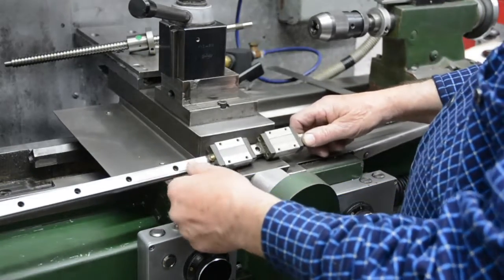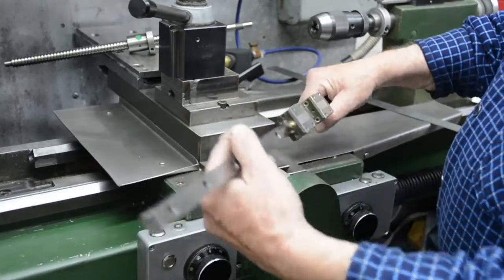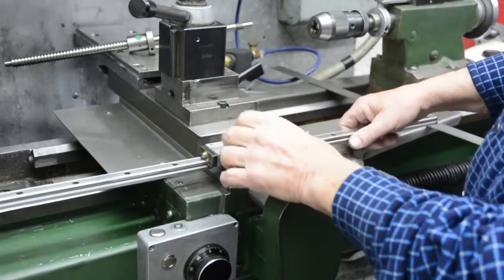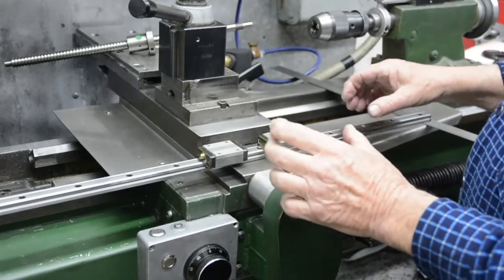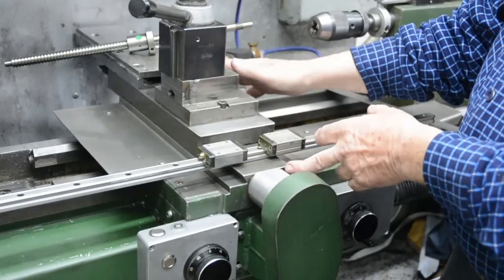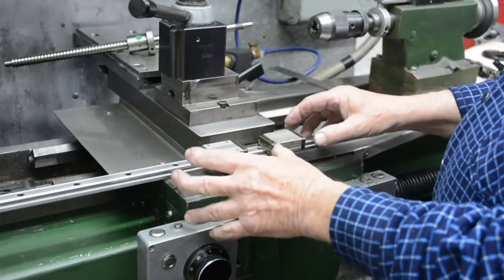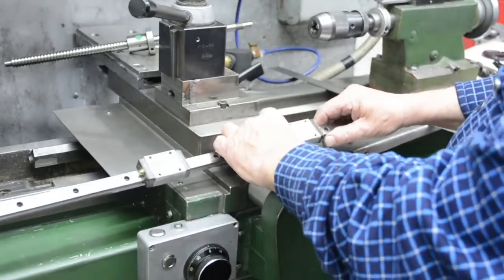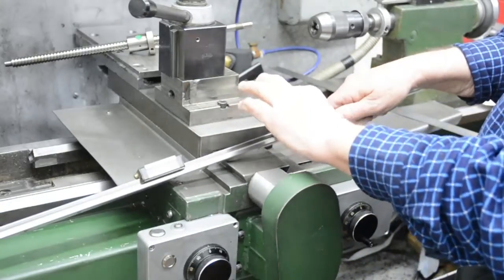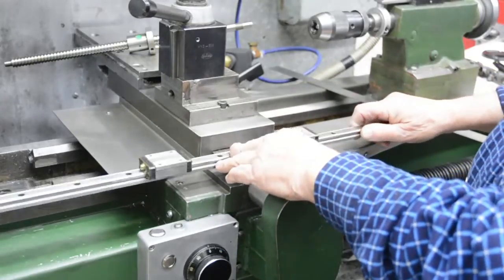Now, the type that I'll be using is a much higher quality type, and certainly not a cheap Chinese one. It's got a funny shaped rail here. This rail is for the future surface grinder — it's 700mm long. For the lathe I'm only going to need about 370mm, about half of what this one is. There are two slides on here, and you can just feel it with the movement — it's so superior to the other one. It's only 24mm in height, which is a lot lower than the 45, nearly half.